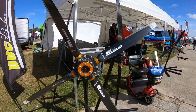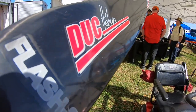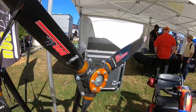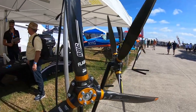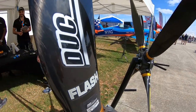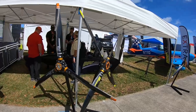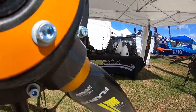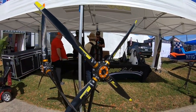We are now offering the ground-adjustable Cobra in two or three blades, and also a variable pitch prop version — hydraulic and electric. For direct drive engines, we offer a hydraulic governor version in two or three blades, covering 150 to 315 horsepower. For engines that do not offer a governor, we offer a full electric version with slip rings and brushes. Even for the Cobra brand of propellers, it's still all forged carbon fiber. The only metal parts are the hardware and the metal spacer — everything else is carbon.